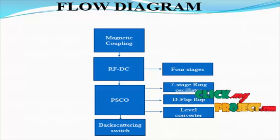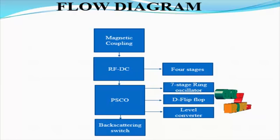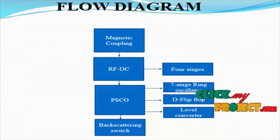The inductor is perhaps the most challenging component in a CMOS integrated wireless power receiver due to its proximity with the lossy substrate and to the fact that it must occupy the outermost area of the chip to maximize the enclosed magnetic flux. A widely accepted technique to improve the quality factor is the use of patterned shields below the inductor. The rectifier topology is based on its high efficiency and simplicity.